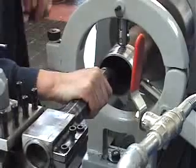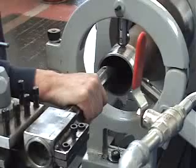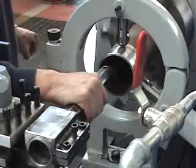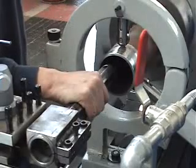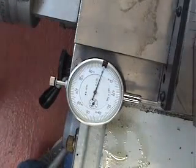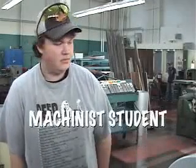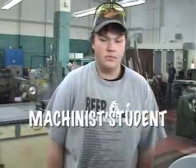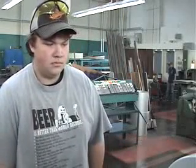I'm getting a bit of tool bar flex, but putting my hand on here will reduce some of the vibration. I'm hoping that once I get that high spot out, the vibration problems will diminish. I like to use a dial indicator on my machines to show depth of cut. He was good enough to finish machining this for me — now, because we bored it right through, he's going to cut the corners, flip it around, and gently cut the inside and outside on the other side without using the steady rest, doing the cleanup.